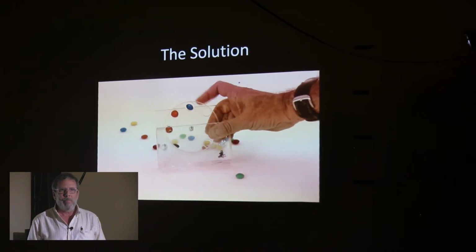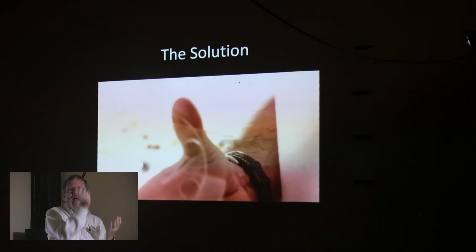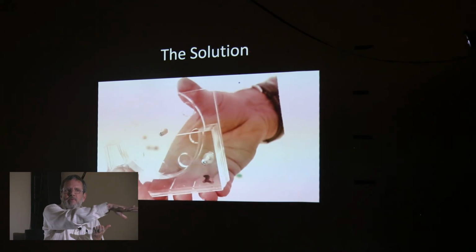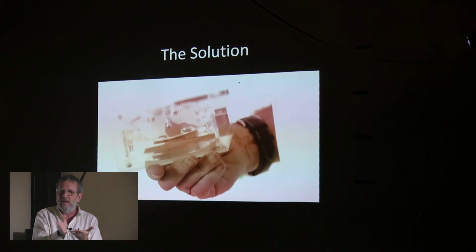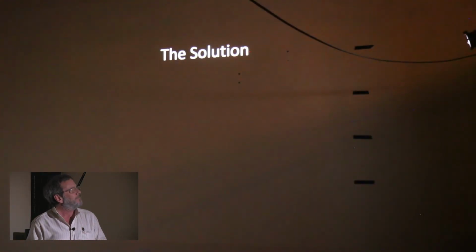Wait, so it's a big difference if the shear force happens after it's been fitted into a hole just by gravity? Yes, but there's really very little shear at that point. You're just sort of dragging it along. You're not shoving it underneath something. It just falls through. And the idea was to just keep it falling through the machine wherever it goes. Don't try and shove it underneath something, because that would squeeze it. Let gravity do that. Exactly.